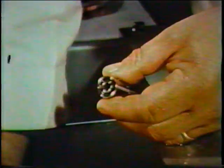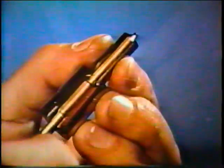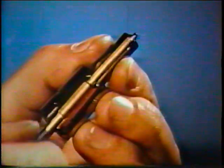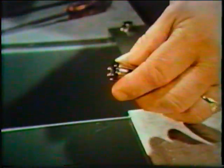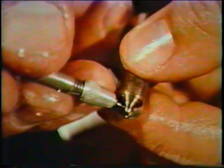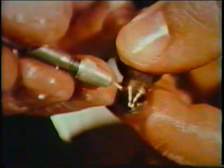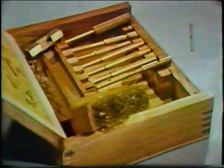A third scraper clears the seat of dirt and carbon. Any remaining would, when testing, cause dribble at the nozzle tip. To clear carbon from the spray holes, use the probe supplied — never a piece of wire. Use the tool as short as possible and with extreme care, gently rotate rather than pushing to and fro.